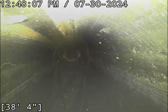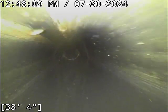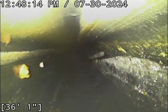Very shallow here, only about, I'm getting between 1'7" and 1'8". Most consistent depth though was 1'8". I jotted that down on the ground there. Very, very shallow, extremely. Which is a great thing for digging the line up, not so great for attaining grade though.